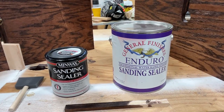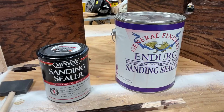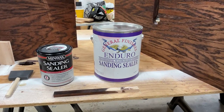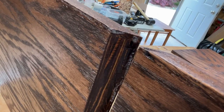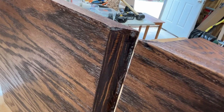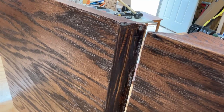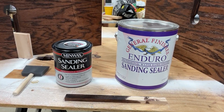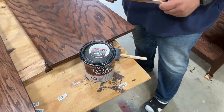One of the key things to remember when applying this is you do not want to end up with bubbles. Unfortunately, using the foam brush generates quite a few bubbles on the top layer — I'll show you what I'm talking about. If you don't eliminate those bubbles, you'll end up with something like this. Now in this particular project, it's a wine rack that's not going to be seen and I can sand that down, but if it's on a finishing surface, that's going to be problematic.